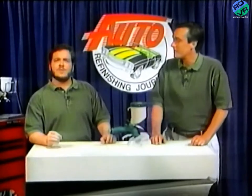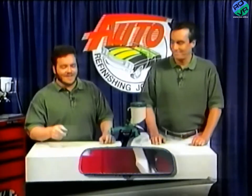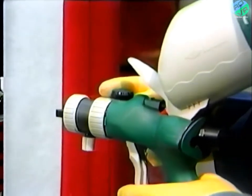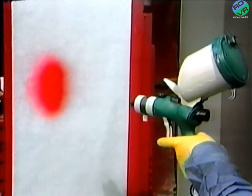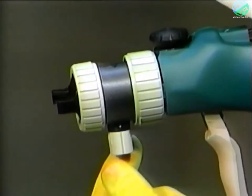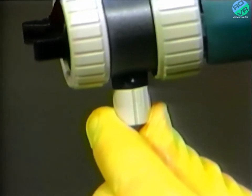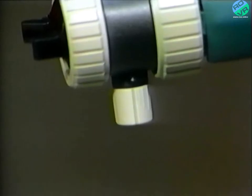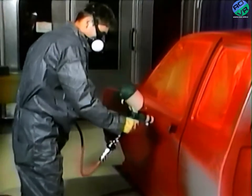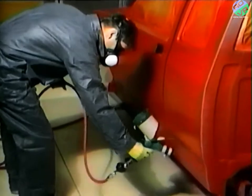DeVilbiss has made it easy to adjust the OMX for any type of material and for the most exacting painter's requirements — easy enough for anyone to use, but giving the finish quality that perfectionists love. To adjust the fan pattern on the OMX, the black knob just in front of the top trigger produces a spray pattern that goes from round to full fan with just a one-quarter turn. The multi-flow fluid adjustment underneath the spray head lets you adjust your paint flow to correspond to fluid tips from 0.8 millimeters to 1.8 millimeters in diameter. It's easy to spray the full range of waterborne and solvent-based materials, including low and high solids, and you can return to the same perfect settings time after time.